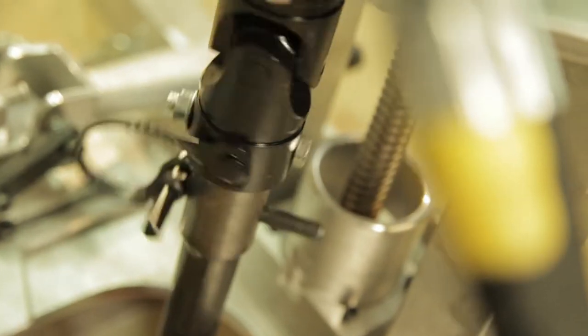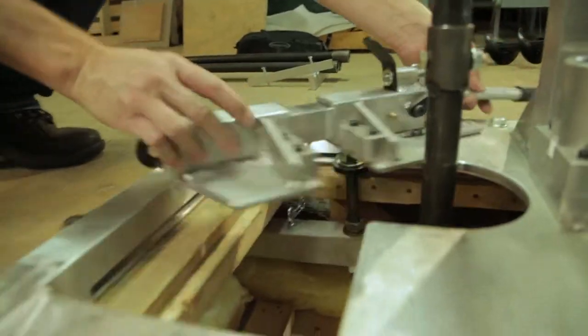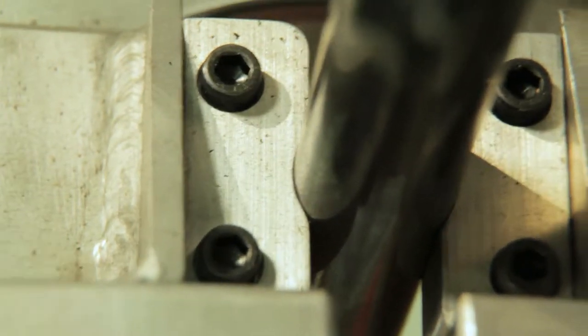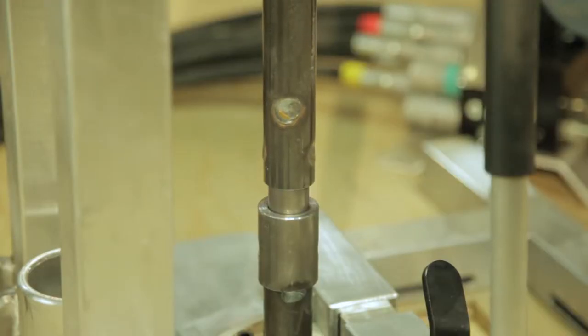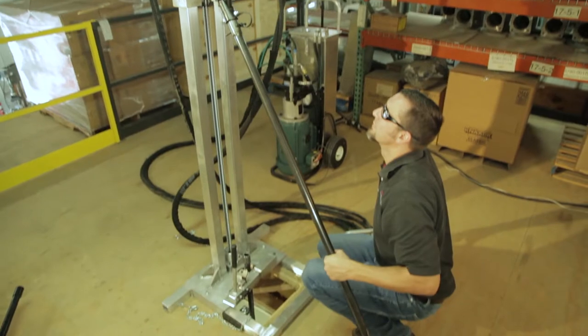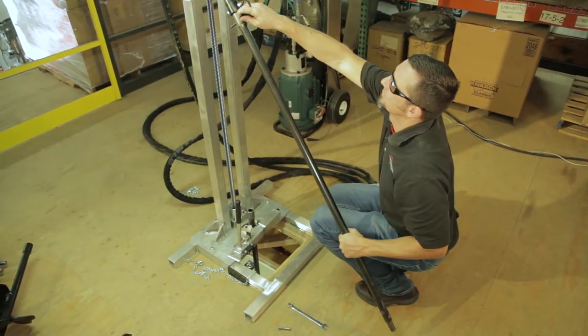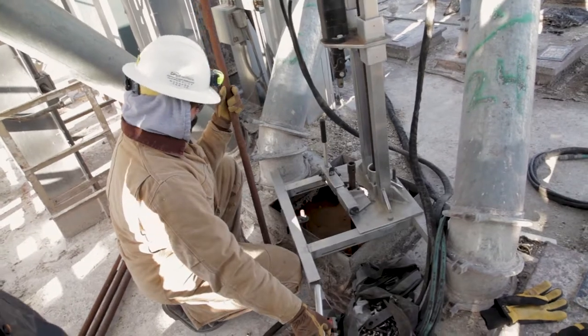This helps back the bit up through the hole and ensures smooth removal. Stop the drill deck when it's about 4 to 6 inches from the top of the ball screw. Engage the drill section clamp and remove the cross pin and cross bolt to free the section from the assembly. Run the drill deck back down, slowing as the drill rotation motor pin approaches the clamped drill section.